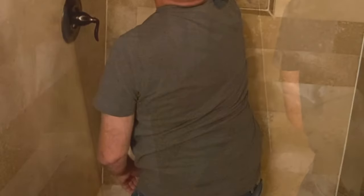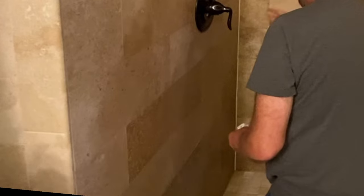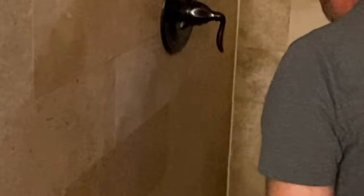By wetting your finger you leave a nice smooth look. The key to smoothing is getting the right size bead. I had some gaps in the tile where there wasn't any grout, so I'm going a little bit wider. I personally think the skinnier the bead the better it looks. Get however big a bead you need, and when you wet your finger to smooth it out, don't squeeze it all the way in because you push it all out to the sides — just barely hit the bead and smooth it out.